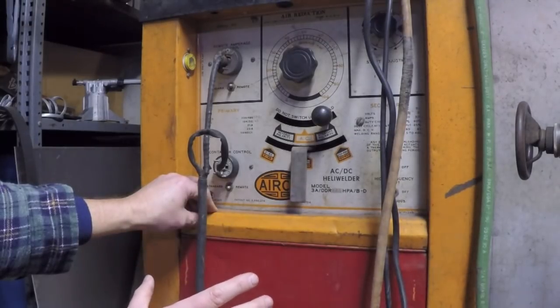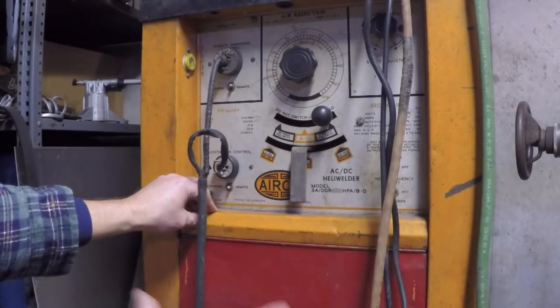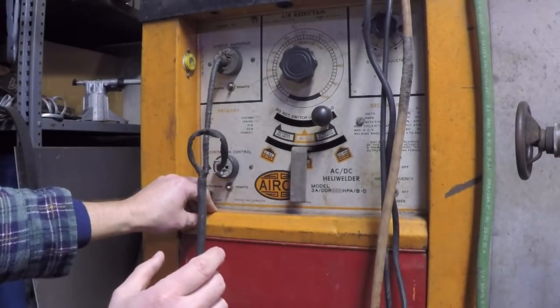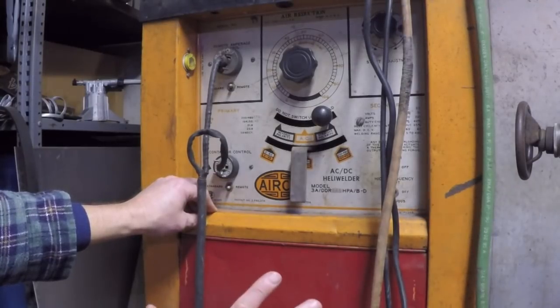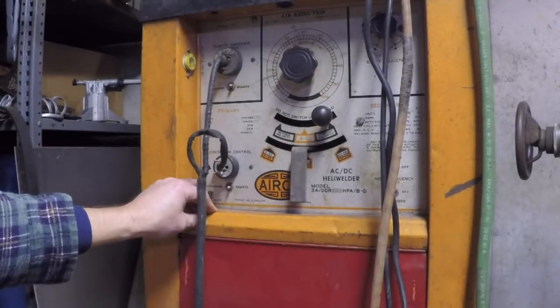What that control circuit does is it uses a smaller, lower voltage and current on a special winding on the main transformer to affect the magnetic field in that transformer and to increase or decrease the current flow in the secondary of that transformer. The secondary of that big huge transformer is either rectified for DC or sent straight out for AC. And that big transformer is being controlled by a smaller voltage. And that's actually a very common scheme that's used in any number of different devices.